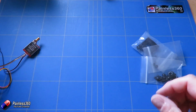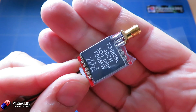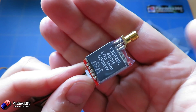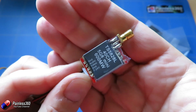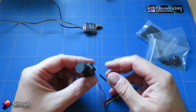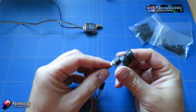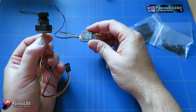The camera and FPV transmitter that you get with a kit is probably one of the weakest parts in my humble opinion. The power distribution board caused a couple of headaches with cable routing, but this is a cracking little FPV transmitter — apart from the fact that it's 600mW. For the majority of places that's just way too much. We need 25mW for racing, and a lot of race organizers these days won't let you race unless you're running 25mW.